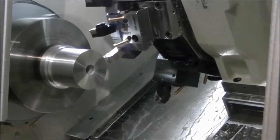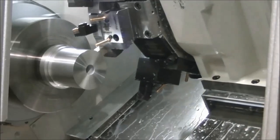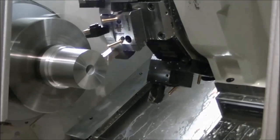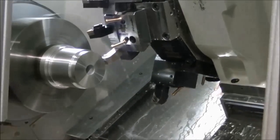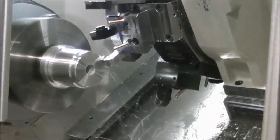In this demonstration, the Okuma Middle Index function with tool holders made by Velocity Sumatic is operating on the LB3000EX. This special feature allows you to take a standard 12-station turret and increase to 24 stations, doubling the tooling capacity.